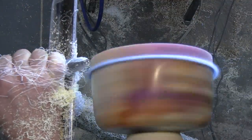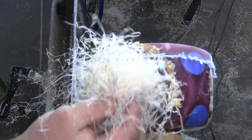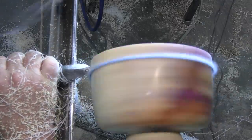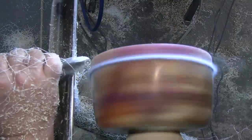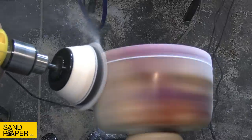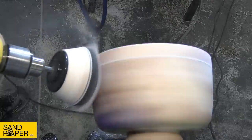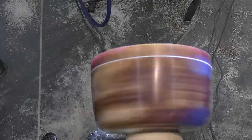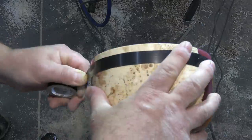Very, very light cuts here. If you look at the orientation of the Hercules, you are very unlikely to get a catch when it's in that configuration — and just showing those really fine shavings, which is exactly what you want. I did find that blue paper towel was really irritating me, so I tried to cut some of it away. Eventually I get it down close and go to the sandpaper — it was sanded from 60 to 800 again. That's why I said I didn't really need to do the buffing on the outside.